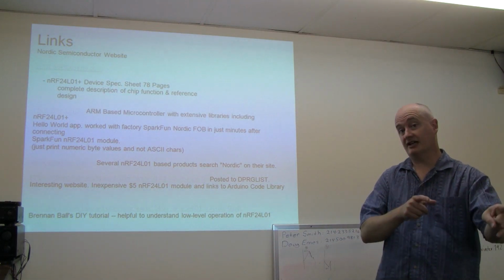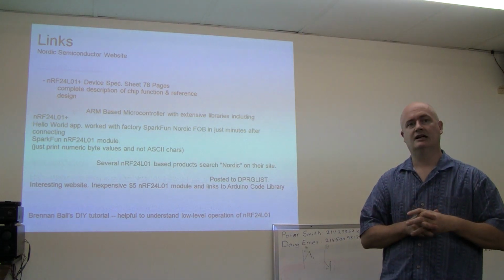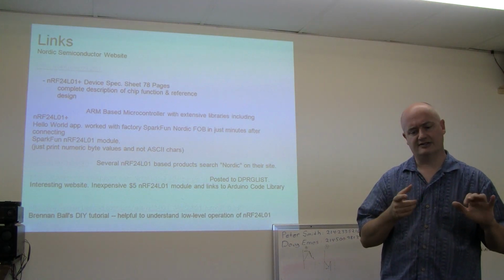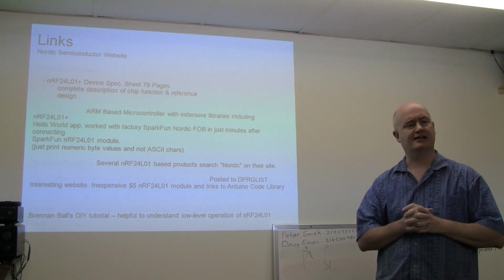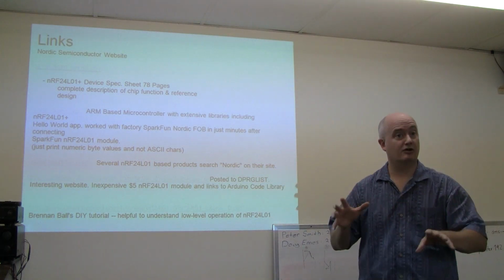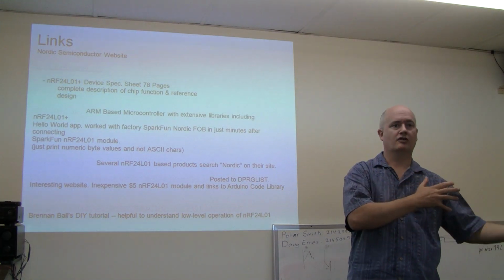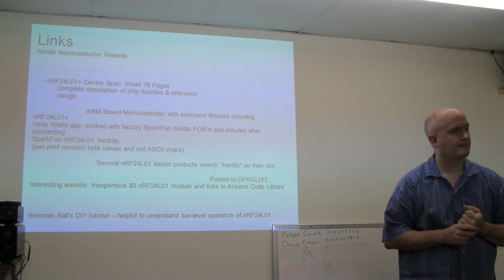Anyway, and of course the XB will do longer packets. I thought that was interesting. This will only do 32 bytes. This will buffer the packets with onboard FIFOs. But the other thing is the XB, well, Series 1, I guess, kind of almost looks like this. But to do something more like the Series 2 mesh network type stuff, now you're talking about a big software project. And that would be much more overhead for a host controller. But go ahead. These chips have the mesh capability already.